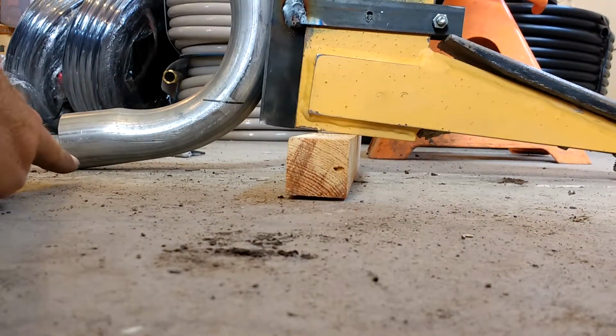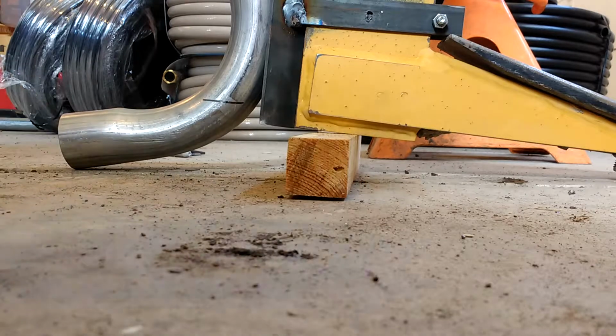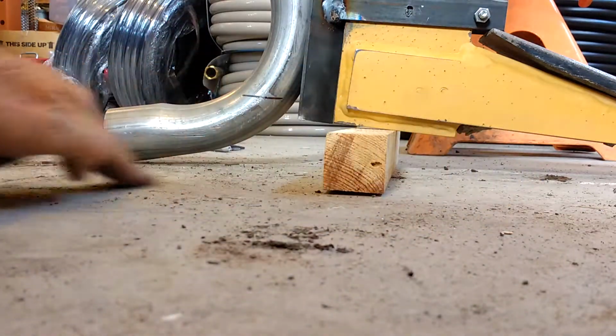And then the second thing is, as far as the pipe layer goes, where do I want it in relation to the hole being cut? So right now, the tip of the subsoiler is on the ground. That means if my tractor was dragging it straight forward, it would be cutting at this level on the ground here on the concrete.